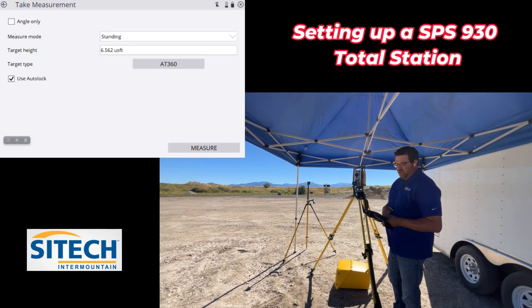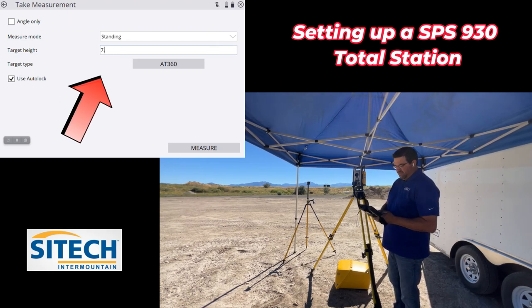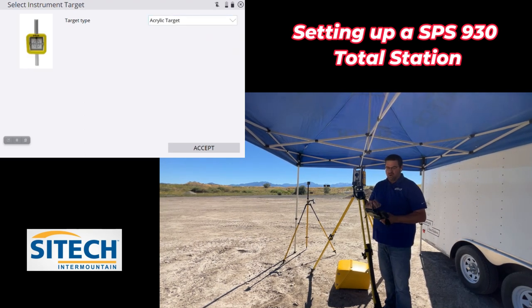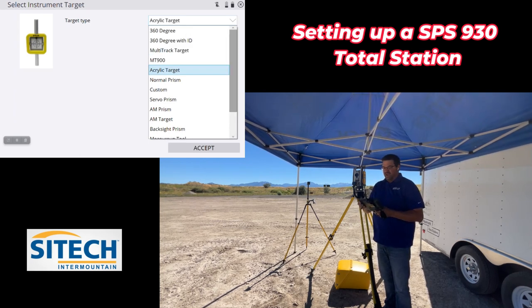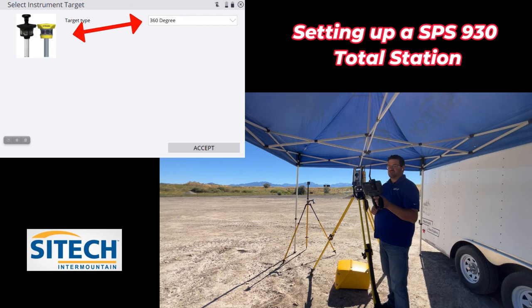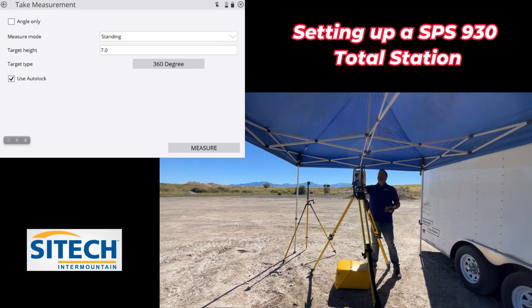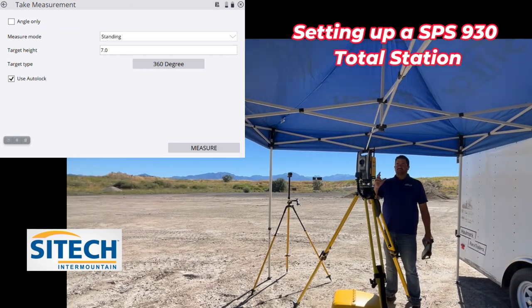I'm going to hit add point. On the screen right here, I can either click it on the screen or go to the menu button to find it that way. I find it easier to just zoom in on my control points. You can see the three that we've got here that we set in the other video — North Complex Control. Before I really worry about putting the total station on it, it doesn't know what target I'm shooting yet, so I'm going to hit select. The next screen is going to ask me what height it is over there — I set that at seven foot because it's got that extension on it.